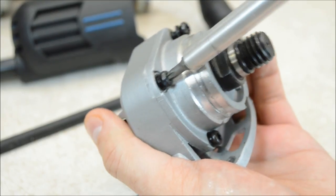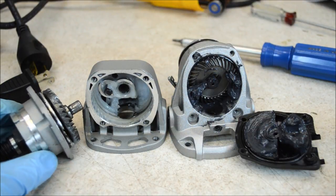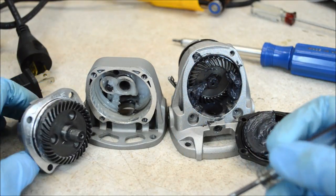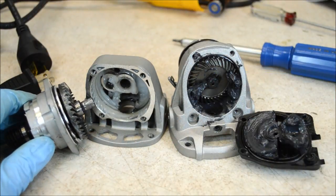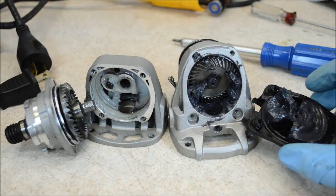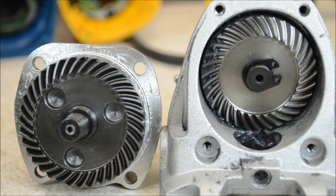We're going to keep digging into these grinders and check out the gears. There's a basic design difference in how the gear case is assembled. On the Harbor Freight, like all the grinders I've taken apart, there's a cast bottom plate, the main shaft runs through it, there's a gear and a bearing down in there, plus a rubber seal to help keep the grease in the gear case. On the DeWalt, you get into the gear case through the top — there's a plastic cover plate on top, but it also has the same rubber seal to keep in the grease. Some cheaper grinders skip this step.